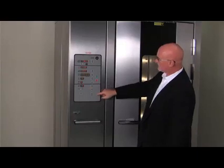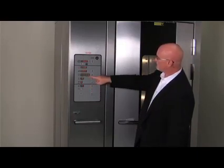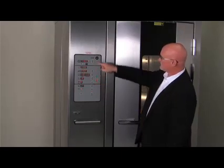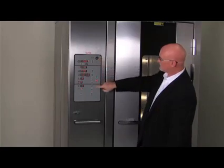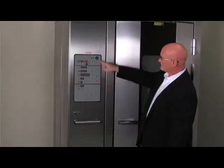Enter the new bake, steam, and airflow delay settings. To change the settings in a step, press the up arrow in the step section and make changes to each step accordingly. To store the recipe, press the recipe up or down arrows to move to the next recipe number. Finally, press the power on/off button to exit the program mode.